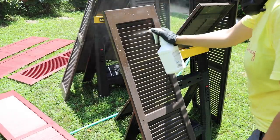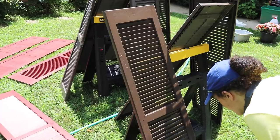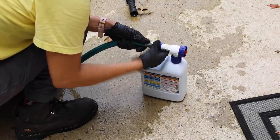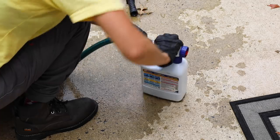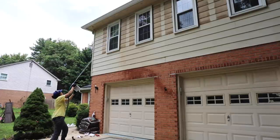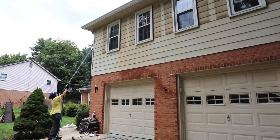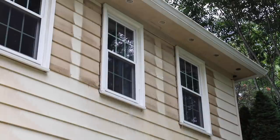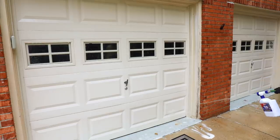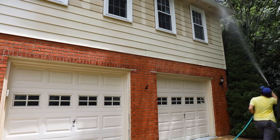Troy cleaned the windows while I cleaned all of the shutters. Once you've sprayed the cleaner degreaser, spray it off and make sure they're ready for paint. For the exterior, I connected a 30-second cleaner to the hose, picked up from the hardware store. This is a great way to clean your exterior without needing to get up on a ladder or have a pressure washer. What I've learned is that you don't want to pressure wash your siding, because that pressure could actually go behind your siding and damage your home. Just spray it on and within 30 seconds to a minute it starts cutting through the gunk, then spray it off — it's amazing.